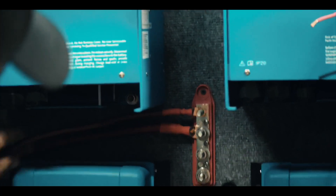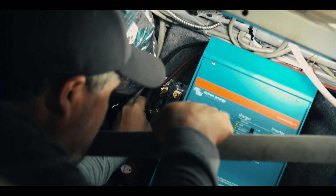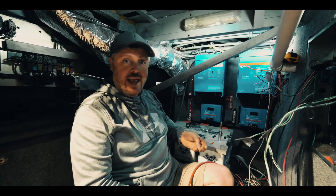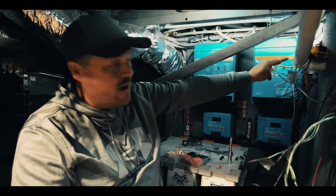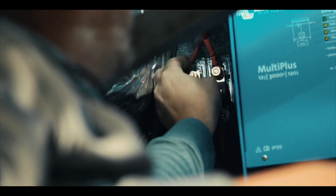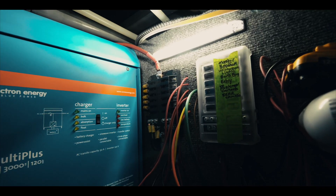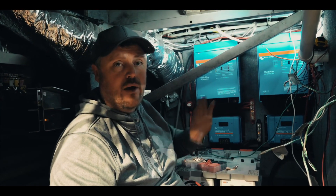I've got both my wires done and ready to go into my fuses. Both of my main runs coming from my bus bar are connected to my 150 amp fuse holder. Now I need to connect two wires going from there to my fuse panels over here. I've got my first fuse panel hooked up and now I only have one more to do, and that for the most part will give us 12 volt power throughout the entire bus.